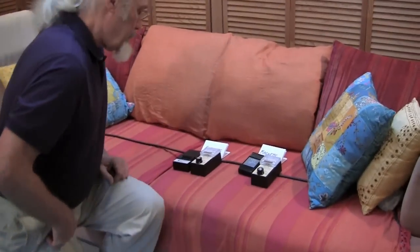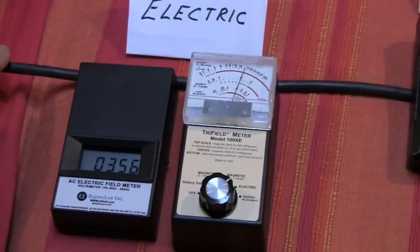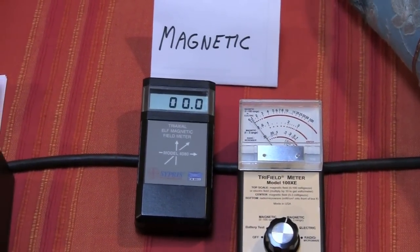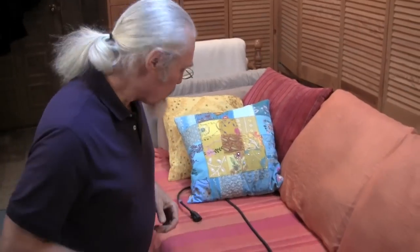This is part four. The dirty electricity filters can add magnetic fields to the wiring as well as the magnetic fields you get from the filter itself. This extension cord is on — it has voltage on it — you can see the electric field on the meters. But there's no magnetic field because there's no current yet, nothing is flowing. Once we plug in a filter, there will be electricity flowing to and from this filter, doing that balancing act — like the pressure tank giving and taking water as needed.